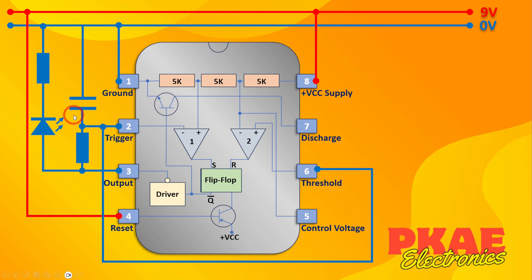The downside of this arrangement is that your load will affect the duty cycle and the frequency, so you can't get anything really accurate here. If it's a fixed load you can work it out; if it's a changing load then it will keep varying the frequency and duty cycle. But for a flashing light where you're not too fussed about the exact frequency and just want to get the right effect, this is absolutely fine.